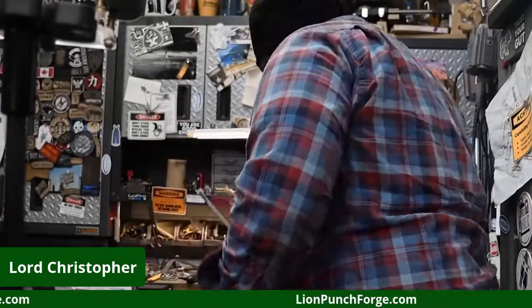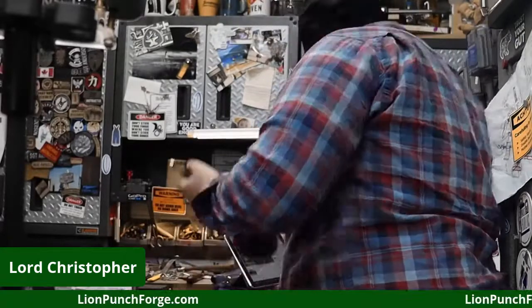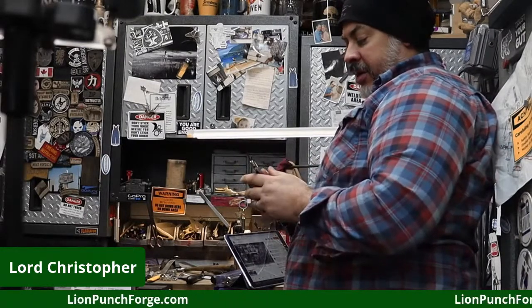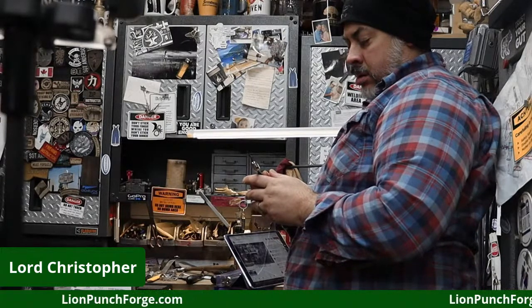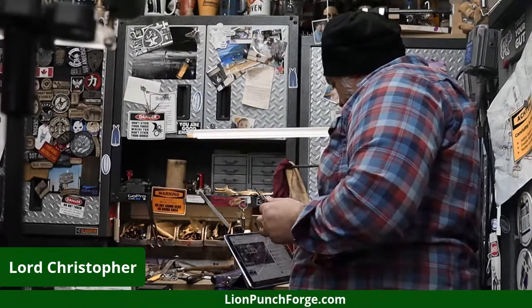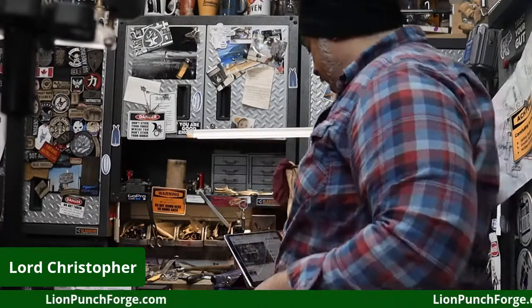This hammer handpiece already has an engraving adapter in it. I'll place it in the flexshaft, lay the tip down, barely press my foot pedal to move it into place, then click it in. What you're looking for in controllability is your ability to do just a couple of controlled clicks. I'm practicing only a couple clicks at a time — you can hear the percussion.